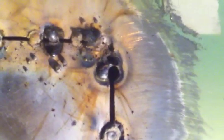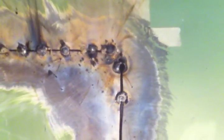But yeah. And then the first one I blew through, like I told you. I blew through right there, and then I changed the settings, and then I hit that one. I tried bridging that one over, and then I tried filling it in with wire, trying to refill that hole. I knew it was going to get too hot there, and obviously it got too hot. You see the color, and it also warped the panel right in this area.